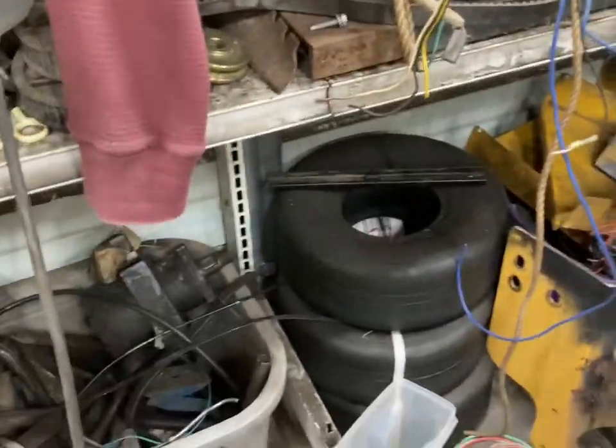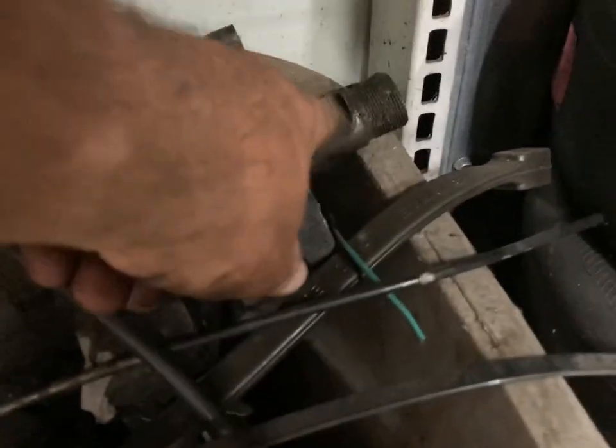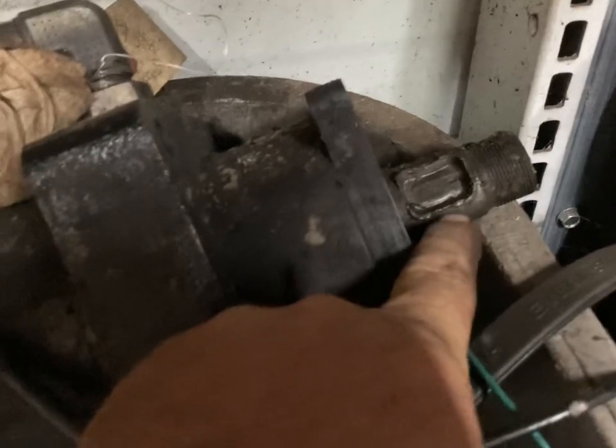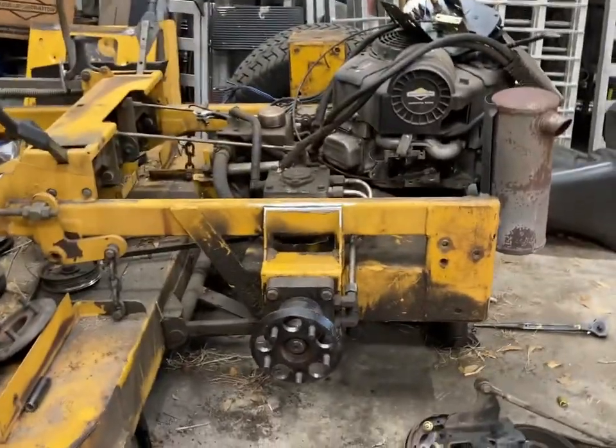You don't want it turning independently. And if you ever run a machine and you notice a little lurch going forward and reverse, stop and make sure your engagement is correct. Because where there's supposed to be a keyway — about a quarter inch or whatever — that's what you'll end up with: a worn-out keyway on an otherwise good wheel motor that you can't use.